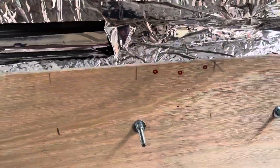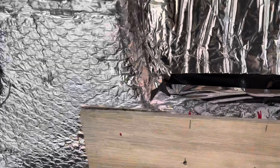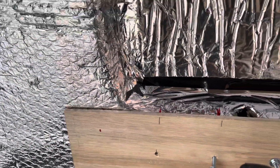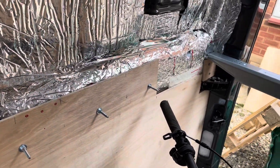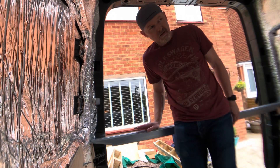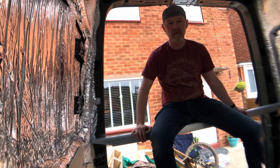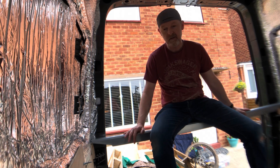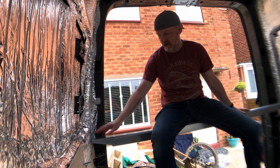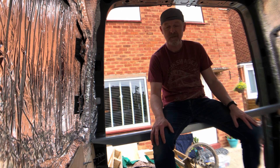The middle beam will be bolted through the outer two top holes, and possibly through the middle one as well, with the end self-tapped again into the metal — that'll be pretty strong once the frame is all together. Now the acid test — let's see if it supports my weight. Pretty solid. The middle one's going to be bolted; these are self-tapped straight into the frame. It's going to take the weight of two people. Job done.